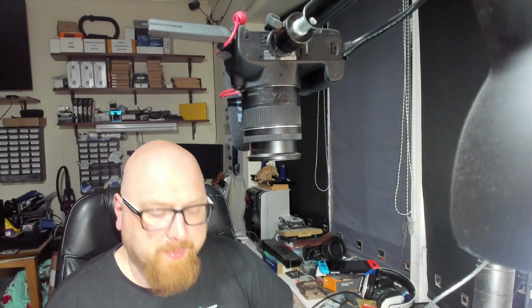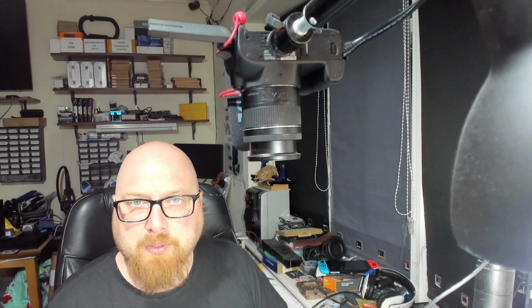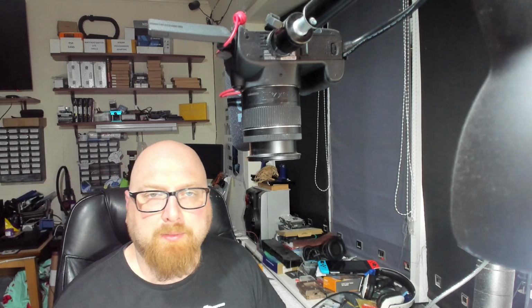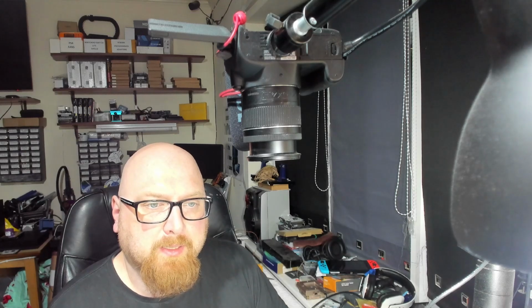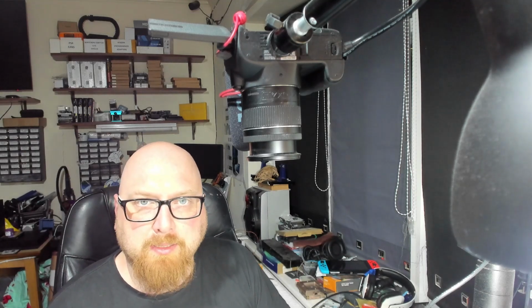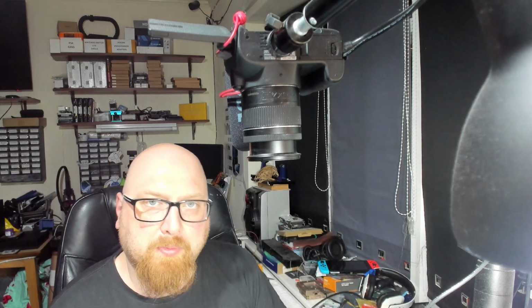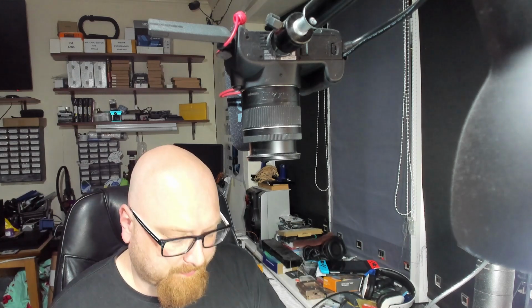Alright, so as you could see, this process was quite easy. Some of the points, like the DAT0, was already soldered, so I didn't touch this. The 1.8 volt point was also already soldered, the jumper wire. So what I've just done, I've just replaced the ribbon tapes on the APU and another one just above the APU. And I just soldered some points, and that's it. So the job is done.